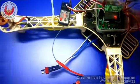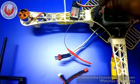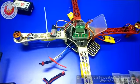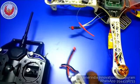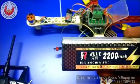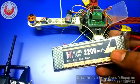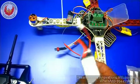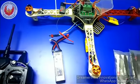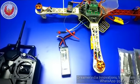There is also a buzzer. This buzzer indicates when a low voltage is detected, so we can safely land the quadcopter. The battery we are going to use for this quadcopter is a 35C 3-cell LiPo battery, 2200 mAh. This battery is sufficient to run the quadcopter for 30 minutes.